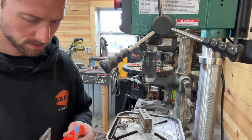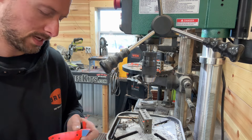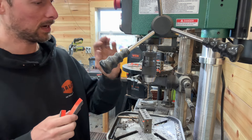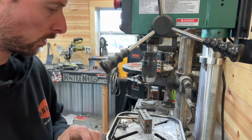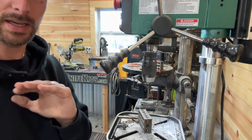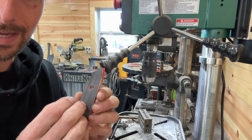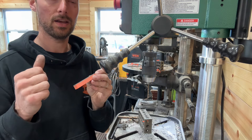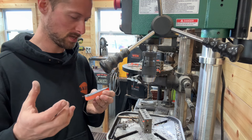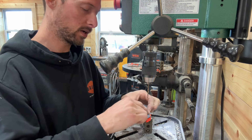For the next step, we've got our scales. I'm going to pop these pins out — this one's a little tight. There's a really fine line between having your pins perfect, and I'd rather them be a little bit tight than a little loose. Over at the drill press, I've got a small eighth-inch bit in here. What I like to do is put a bunch of small holes on the side that's being installed on the knife. You have to be really careful doing this that you don't go in too far. I like to go just past the liner into the actual material. I find that it gives the epoxy spots to go into, which in my head just gives it a little more strength and durability.